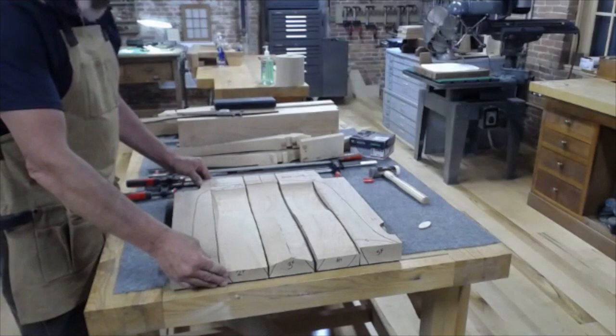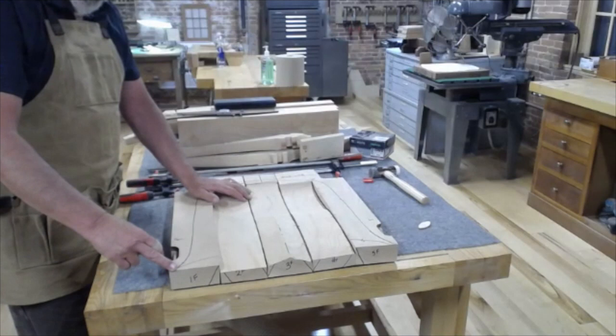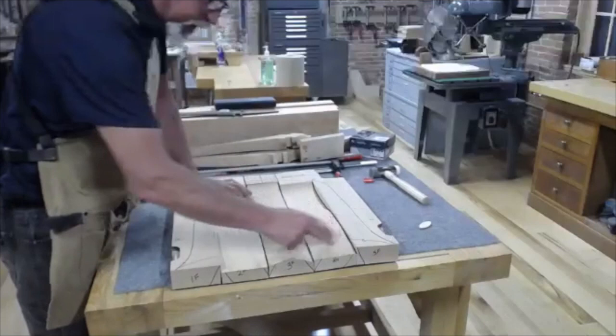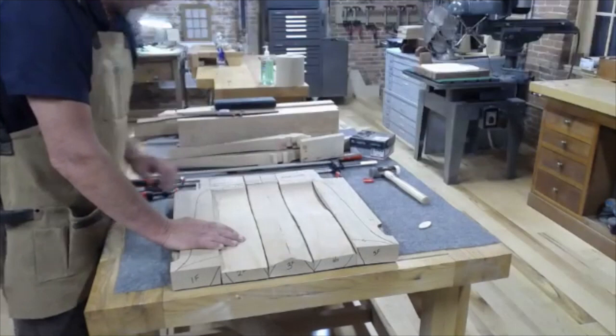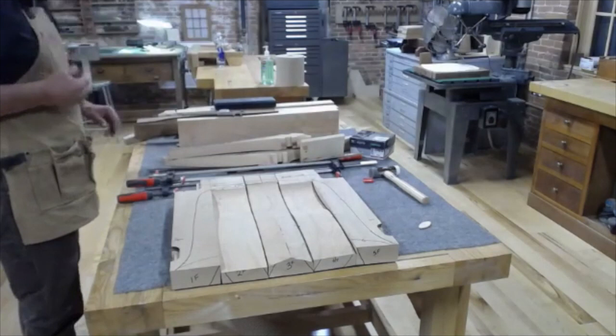So we have the seat done. We need to do a little bit of bandsaw. It's all glued up and everything. We cut off this thigh relief section here. There's a contour that goes here because the back leg only sits to this distance. This much is proud. So we need to bandsaw that. And there are templates for that. I'll provide templates so you can get that.